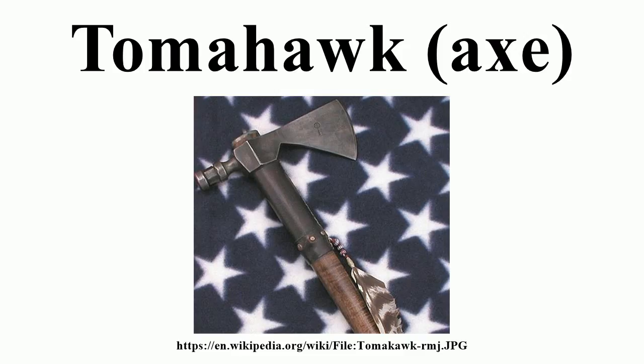Original Vietnam tomahawks are rare and expensive. Tomahawks are useful in camping and bushcraft scenarios, mostly used as an alternative to a hatchet, as they are generally lighter and slimmer. They often contain additional tools such as spikes or hammers. Many modern tomahawks are made of drop-forged, differentially heat-treated alloy steel. The differential heat treatment allows the chopping portion and the spike to be harder than the middle section, allowing for a shock-resistant body with a durable temper.